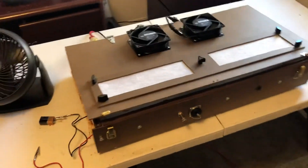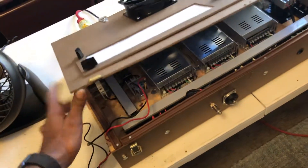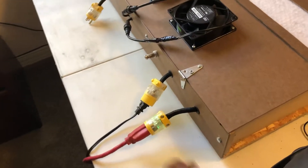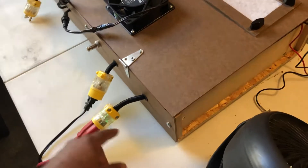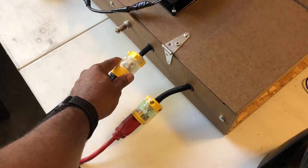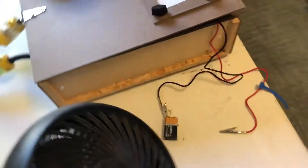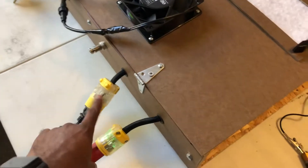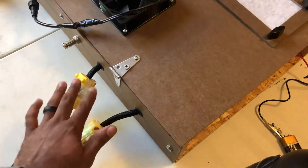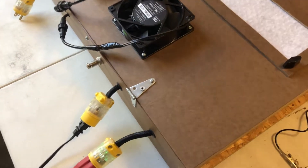So let's have a quick look. This is the box. I do have two cooling fans. It's a little springy — I had some latches because I do have some weather stripping. On the outside, this will be the top. This will be 110/120 volts in. This will be for the CNC, the pump — this is going to be the cooling pump or the water pump for my spindle. There's a relay in here that I'm going to activate with a nine-volt battery, activated with the offline control unit. You have connections for the pump, the CNC, and the cooling fans — I'm going to have four total. Overkill, overthink — it just seems to be what I do. It's like my first child.